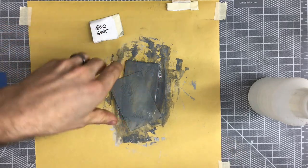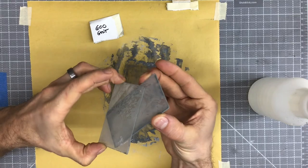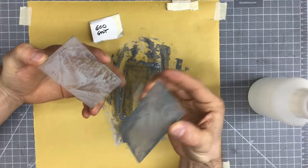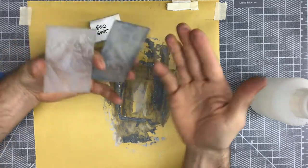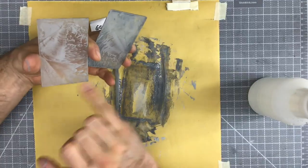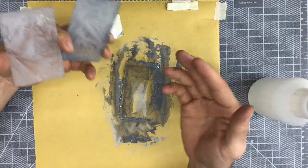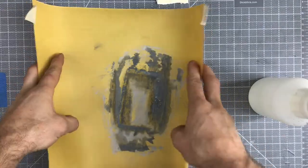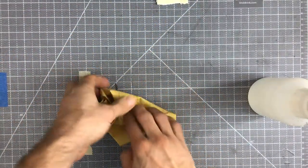Now, what you end up with when you're committing 5, 10, 15 minutes to this is a more and more even and consistent grind. You probably laid some pretty good scratches into your glass right away, and then eventually you start to polish them out, but you're never really going to see what's going on there until you rinse it and dry it. So you can see the mess here on the table that we're going to fold up into this piece of paper.